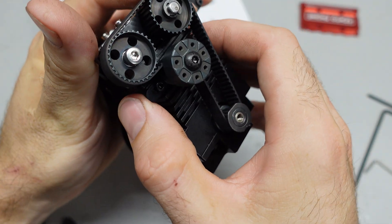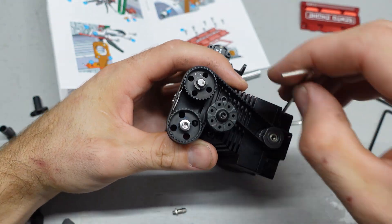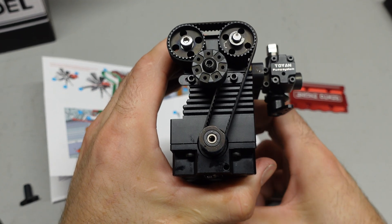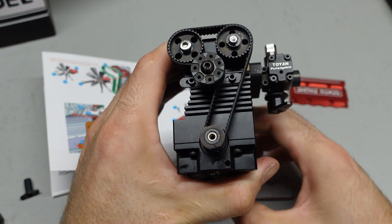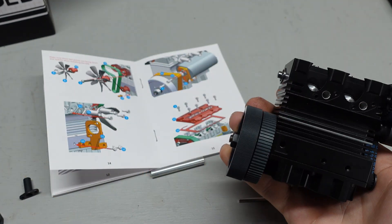The belt is a little loose, so I push the idler bracket over and snug those two bolts to get tension on the belt. The engine is now timed — it moves the cam and everything feels nice. Now we're going to put the exhaust pipes on and the starter bracket that holds the starter motor.